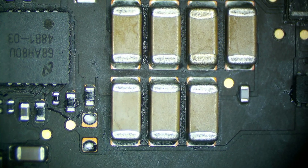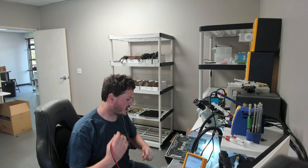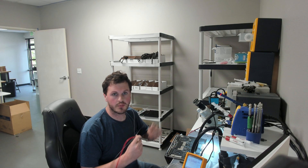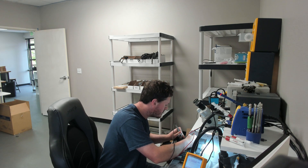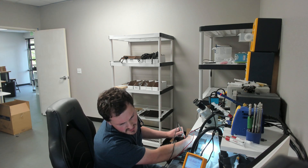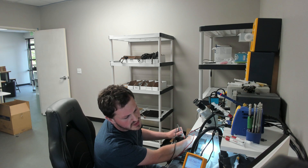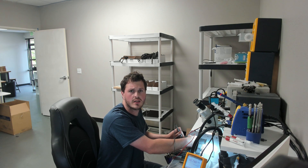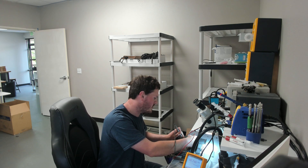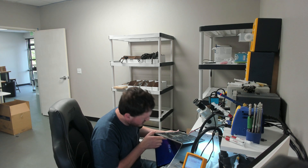Let's put it back in the enclosure and see if it works. I'm going to show you what the voltage on backlight output is now for comparison. Before, we measured zero volts, and now we have 48 volts — that should be good. This rail is very dependent on load and your brightness settings. If you select a lower brightness, you'll typically be on the lower side.